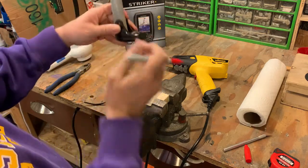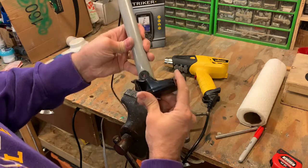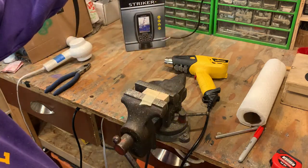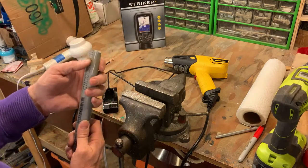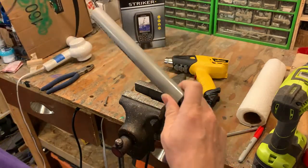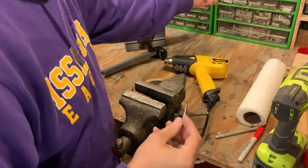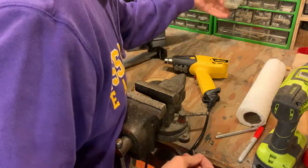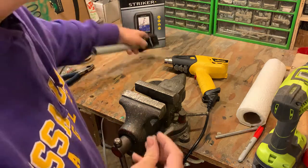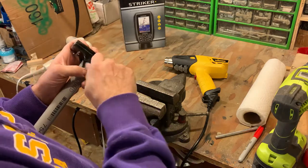You can sand this section down a little bit to get it at the angle you think is most appropriate. If you're someone who likes to fiddle with transducer angle, this mounting system is probably not for you — once it's mounted in there it won't move much and will essentially point straight down. Now I'm using stainless steel 10-24 bolts, and I highly recommend using all stainless steel components since this is going to be in the water quite a bit and you don't want it rusting.